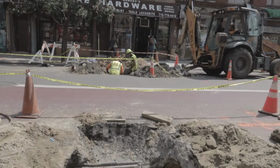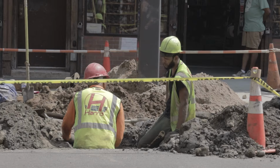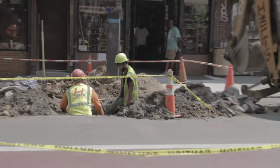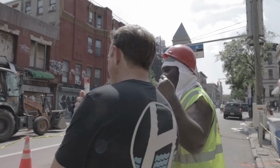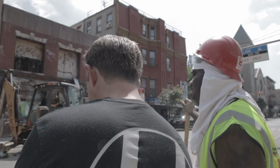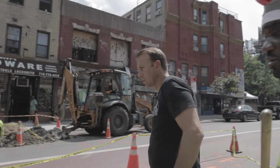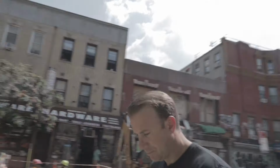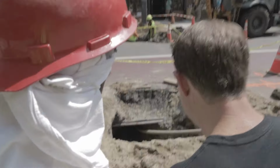All right, so you guys are making really good progress. So when they made that little tunnel from there to the sidewalk, what kind of curb valve do they have over there? Is it a square nut or is it flared? So this is a fairly new line. It shouldn't be leaking like that. It has to be a fitting. But still, if you look at it, it's still a little green there, see? Yeah, that's what I was asking. Right here. See the coloration on it? Uh-huh.